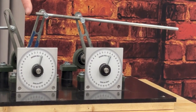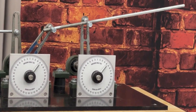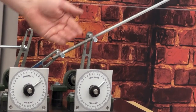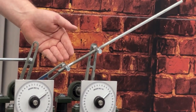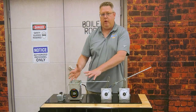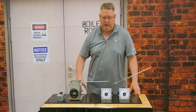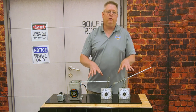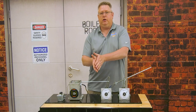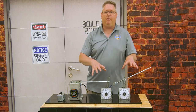We can see how rapidly that receiving arm is driving the jack shaft relative to the driving arm. And as the driving arm approaches alignment with the rod, its travel is essentially going to stop. So it is important when we use a method like this that we may have to re-stroke the mod motor or adjust the relationship of these arms so that we get the full 90 degree travel and we don't get any jamming. Basically these are tools we can use within the limitations of linkages just to improve the relationship of gas and air through the curve, as opposed to being good at low and good at high but off in the middle. We can put these biases in the linkage to really fine tune and optimize combustion.